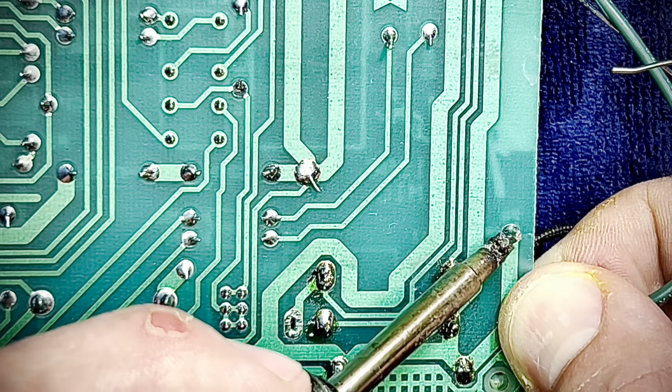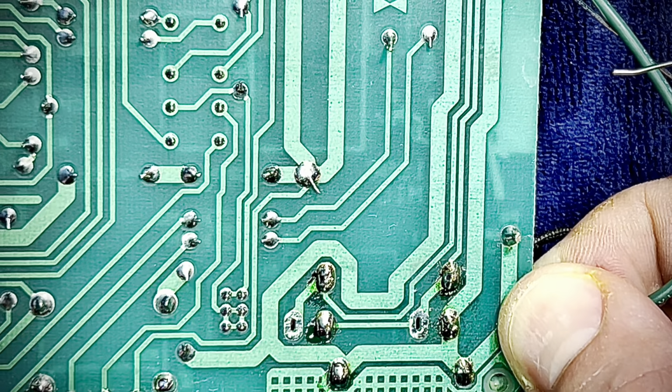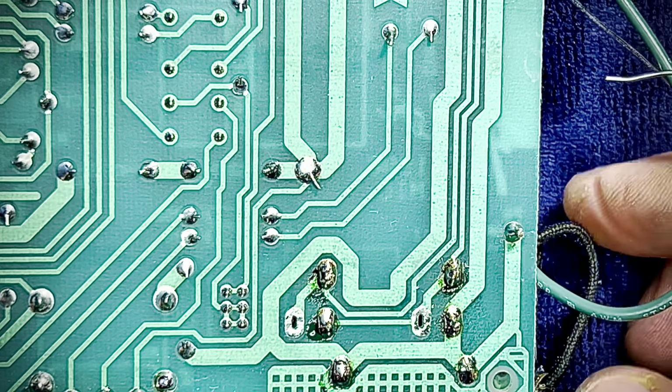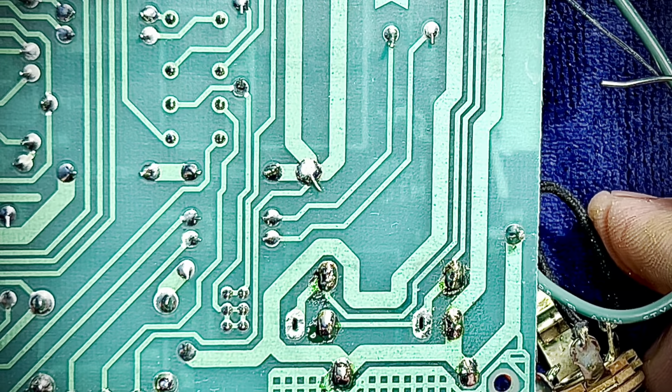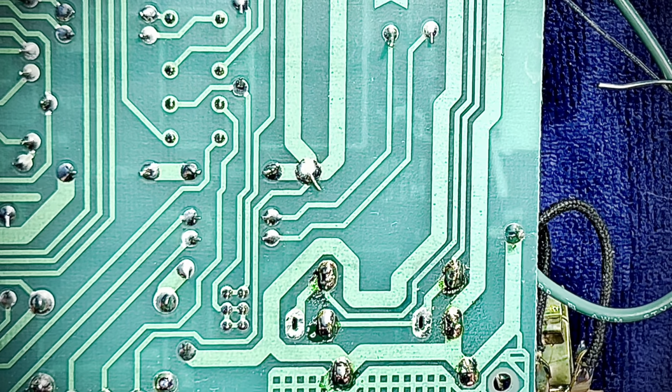And you know what I'm actually going to do in this one? I'm going to do a chassis joint. This is going to end up being a chassis solder joint. And sorry for this non sequitur. But if I'm going to put jacks on, I'm just going to run shielded cable all the way over to the grid. And I'll put the grid stopper right on the grid.